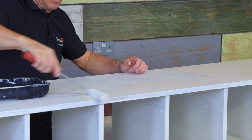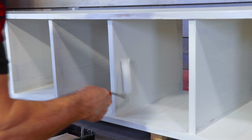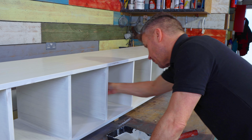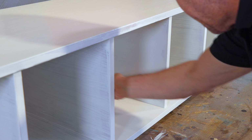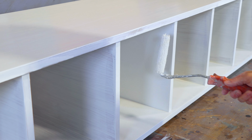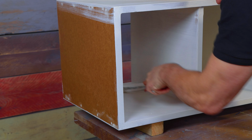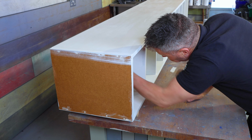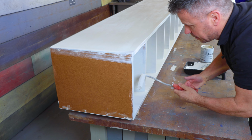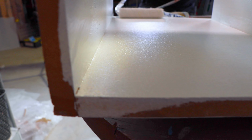Now my piece has had just over 2 hours to dry. I'm going to apply a second coat, again using the brush and roller. Frenchic Paint is the perfect traditional style chalk and mineral paint with minimum VOC content and virtually no odour. The paint I've used is Ivory Tower from the original artisan range. This would require sealing once it's dry with either finishing coat, tough top coat or one of Frenchic's waxes. And of course you could paint your MDF with one of Frenchic's other paints like Alfresco, the Lazy Range or even chalk wall paint, which are all hard wearing and wouldn't require sealing.